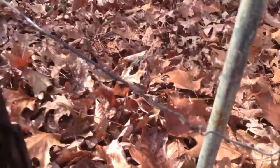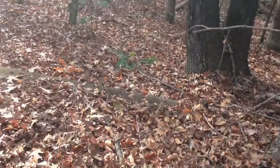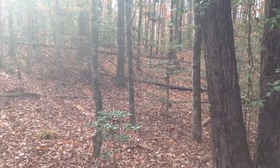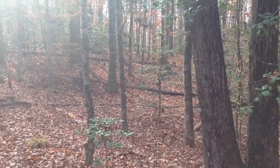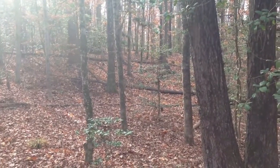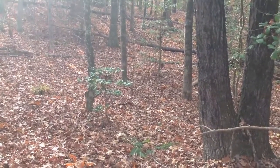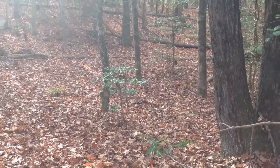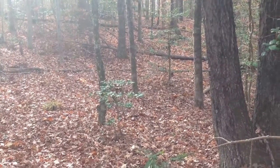The beverage connects with a wire nut. It's a beverage on the ground and it runs out into the woods. This particular one is running away from Europe. I have it un-terminated so that it should be bi-directional — receiving signals from the north-east as well as the south-west. I used it pretty much for all my receiving on 160 meters in last weekend's CQWW-CW contest. I've heard the DX from Europe surprisingly well with the antenna laying on the ground.